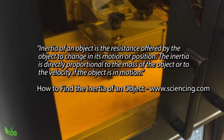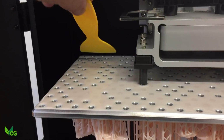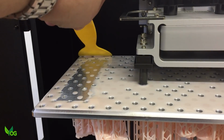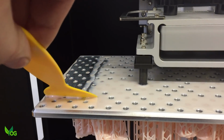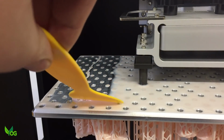And the Z-arm is slow to accommodate the effort. Unfortunately, this means we have a monochrome printer operating at standard LCD speeds, and that's not fast. It's also worth mentioning that because it's flat, the plate never really sheds all the resin. So if you don't scrape the top first, there's a strong chance you'll make a hell of a mess when you try to remove it.